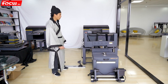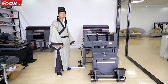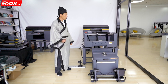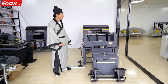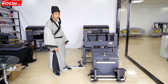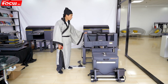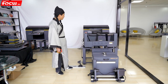First, place the two machines in a good environment. The environment must be very clean without any dust. The temperature must be kept between 18 to 26 degrees Celsius — not too hot and not too cold. If the temperature is too high without air conditioning, the ink can dry too easily and print quality will be poor. Also ensure there is enough space for printing, and the ground must be level. Place the machine on a strong desk that cannot shake.